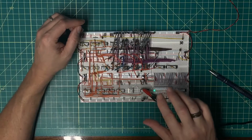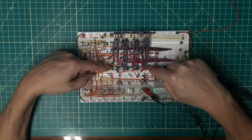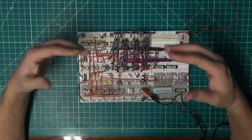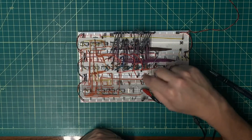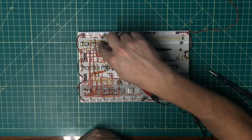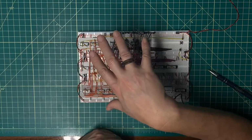Now the behavior here is going to be based on the way these counter ICs work. And it's important to understand that once it's getting ready to carry over, that signal that is normally high goes low prior to the rising edge of the clock so that everything increments at the same time. And so it's the falling edge of that carry out which is then turning around and resetting the set-reset latch for copying, which takes the entire circuit out of copying mode.